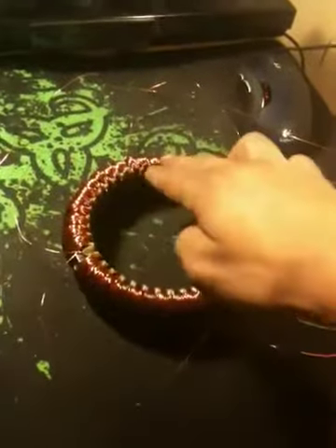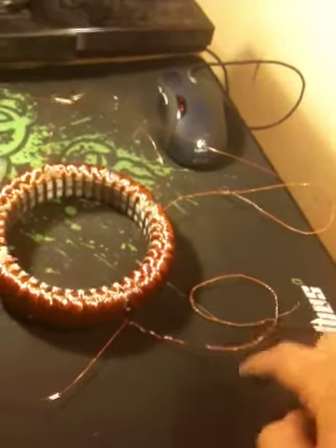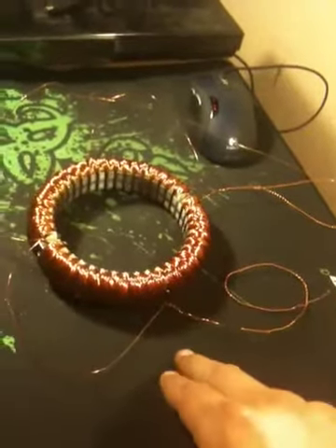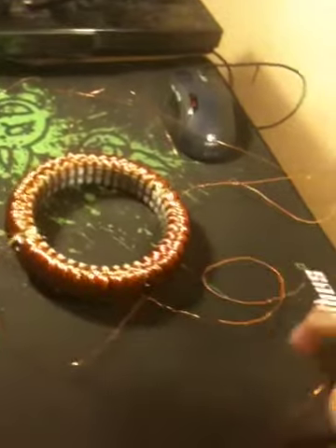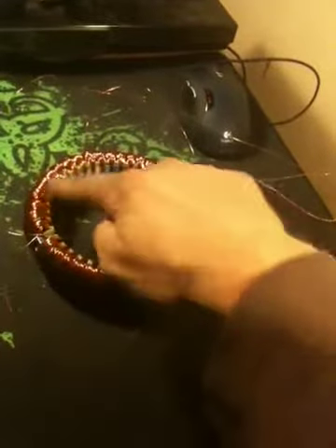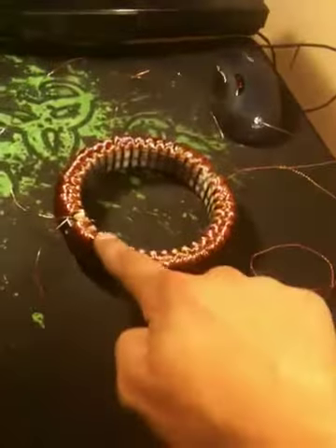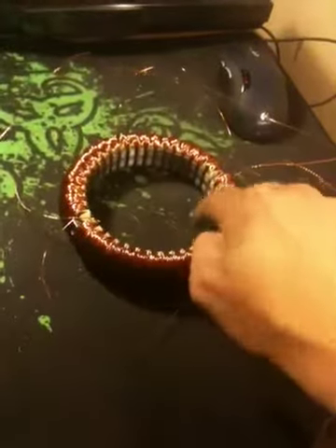The way this is going to work is it's going to have a bar magnet on a rotor, and a two-phase alternating current generator with four slip rings that the ends of these coils are connected to. In a two-phase alternating current generator you have two coils in a 90-degree formation on the inside with two stationary magnets. By getting those two coils to turn around those stationary magnets, you're going to get this bar magnet to turn in response. These coils will be able to send an alternating current back into the wires and the two coils that are not receiving current from the motor.